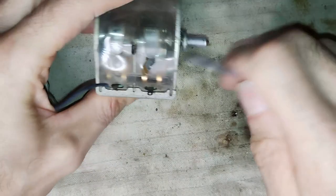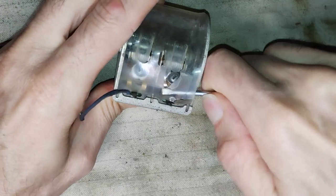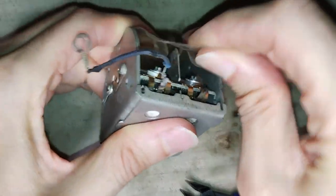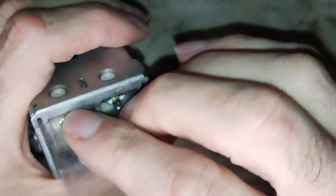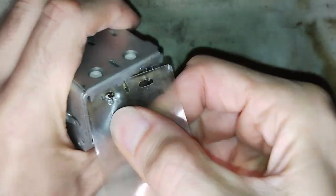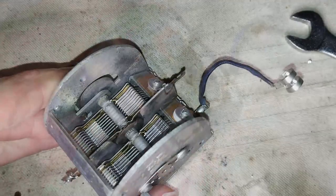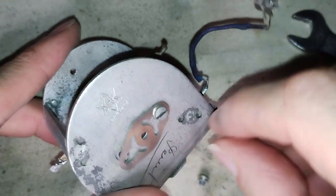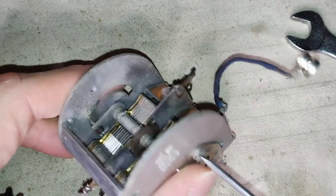This was a very modern variable capacitor, including a plastic cover to keep the dust away from the plates, which in fact were particularly close spaced. Unfortunately, there seems to be no other way than breaking this cover to remove it. It is observed that the rotor blades are pushed too much toward the front, and they should be slightly moved back. After some experimenting, it is observed that the small spring plate at the back is responsible for pushing the rotor forward, and that pressure is what should be adjusted to fix the problem.